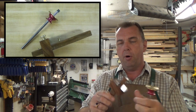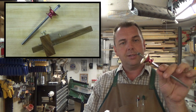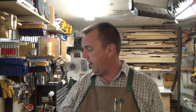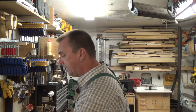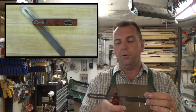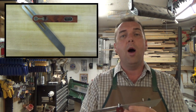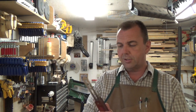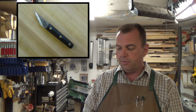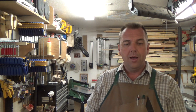There are a couple of marking gauges here and both are adequate for dovetails. You'll use this to score the ends of the pins and tails. You'll also need some form of bevel — a handy little thing in the shop that lets you mark any variable degree you want. We'll probably go with a seven-degree dovetail today, so I'll be setting this to seven degrees. As well, a marking knife — and you can have a fancy one or just use an exacto knife, pocket knife, or scribe. It doesn't have to be fancy tools.